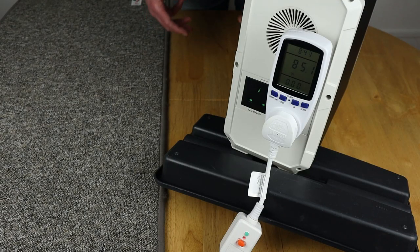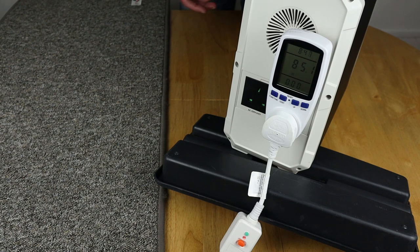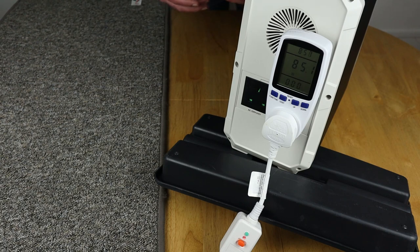Before we start this section, I just wanted to mention a few things. The estimates given here are very rough ballpark figures — in the real world, you may get more or less out of your solar generator. This is based on my 80% usable rule of thumb, accounting for losses and not discharging the battery completely on every cycle. The mains voltages shown are based on the onboard inverter spec, and some may drop as battery charge drops if they're not regulated. Now it's time to move into an area that's really working well for me — actually battery powering my foot buddy.